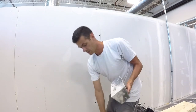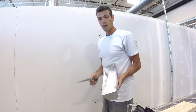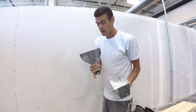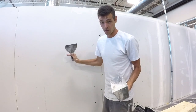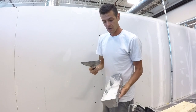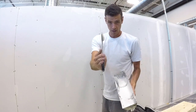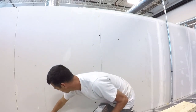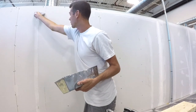Next let's get into speed. You could do it one at a time, I often do, but you might want to use a smaller knife if you're gonna do it that way. I have a six inch right here — if you want to do them one at a time use a four inch. You're gonna be putting less mud on the wall and it's just gonna go faster. However if you want to do it with a little bit of speed, you can take about that much mud and do the whole row — go right from the bottom and wipe them all down.